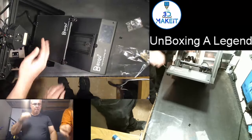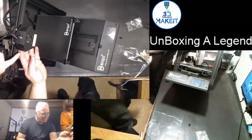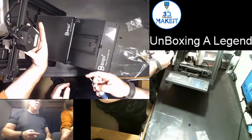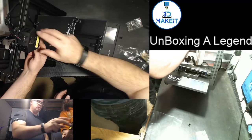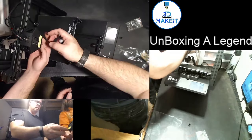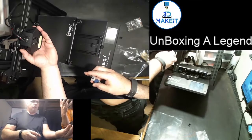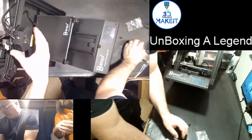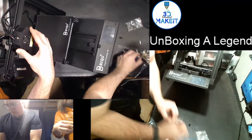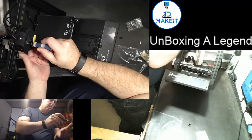The hot end construction is really similar, actually, to Creality clones, except you have two cooling fans on either side. So you've got part cooling from either side. Now, just feeling underneath that duct, they're just actually slots. So they haven't put anything underneath to direct the air. They're just blowing straight out of the blower. So it's a little loose. So we'll just see, tighten that up. I think you just got to tighten those in.